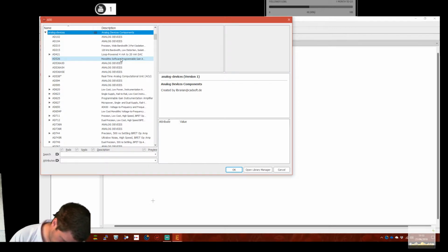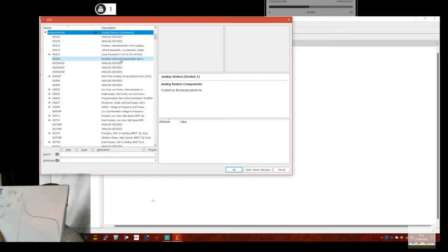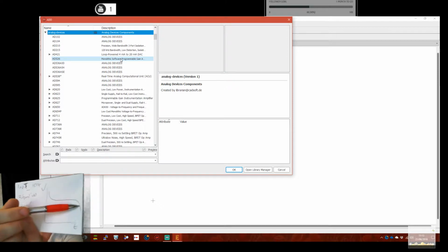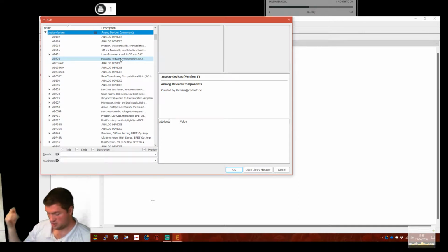which, if I draw you a graph, as a sketch, a lithium battery discharge curve. It's very, very flat, and then it suddenly tails off, and it's at this point you start doing damage to it. So that's what we call a deep discharge. So that's why you don't discharge them below, you know, 2.5 volts or whatever you choose to set as your minimum. 2.7 some people do, but whatever, it doesn't matter.